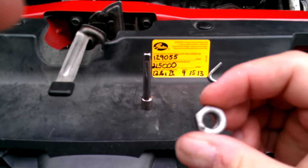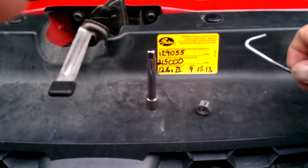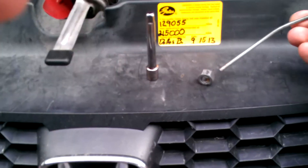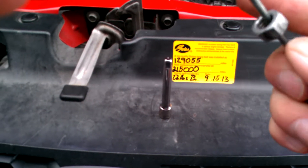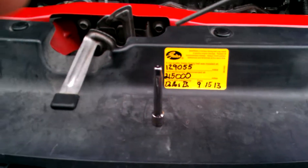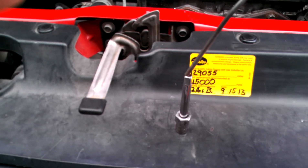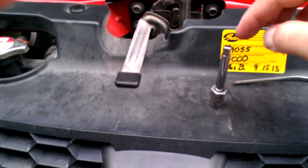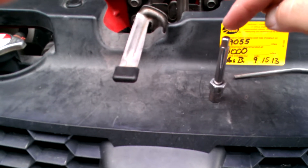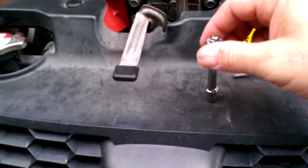But I came up with a really easy way of guiding a nut into a tight place where you're not able to get it in with a socket. Here's an example — just a regular nut, and I found this old tent stake. I ran the nut onto the tent stake, held it in place with my finger, touched the tip of the stud, and dropped the nut down on top of it. The nut would stay, and then I'd reach in with another piece of wire and turn it until it got a bite and threaded right on.